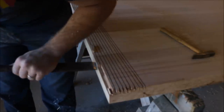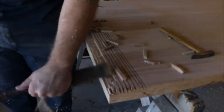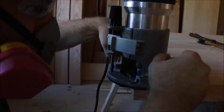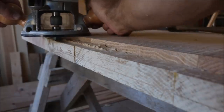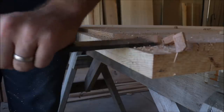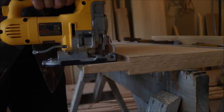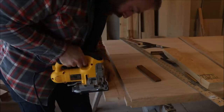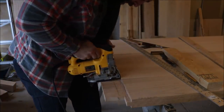Here I'm breaking rules again and using hand tools on the power tool side - I'm taking a chisel and knocking out the first three rows of these relief cuts. Then I'll take my router, which is set to the actual final depth, and flatten that first section. Once I flatten that section I'll repeat this process until I get all the way to my four inches. Doing it this method is actually a lot faster than relying just on the router to remove all that waste. Now I need to cut away the waste to create my tenons - I use a jigsaw here, and because my jigsaw can't quite reach the end I use a piece of scrap to prop it up and finish the cut. There are probably dozens of different ways to cut breadboard ends - these are just some of the tools I had at hand and the method I use.